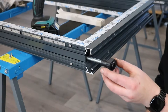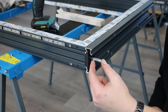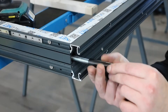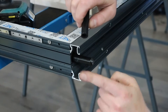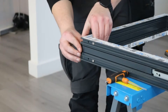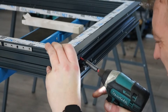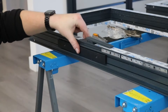With the threaded rods in place, these can now be cut. The rods should be sticking out from the ends of the sash and the sash extension by 23mm on the top and bottom. Once your threaded rods are cut to length, screw the bullets on — all the way to the ends until the rod is flush with the ends of the bullet, and the flat part of the bullet is pointing towards the thermal. Then put the shoot bolt guide into place and repeat at the top. With the shoot bolt guides in place, screw the gearbox cover over the top to neaten it up.